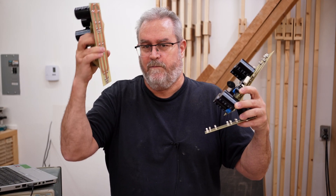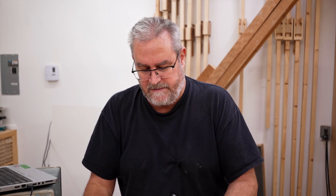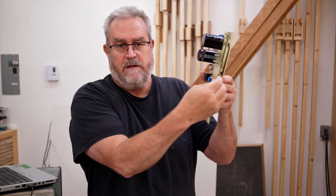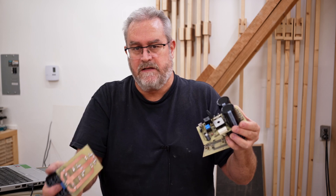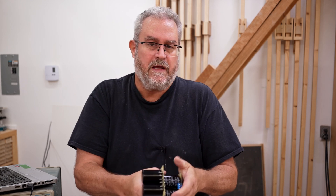These distribution boards are fed from the power supply boards. One power supply board goes with two of the longer distribution boards, and that'll cover one transformer. The other power supply goes to the shorter boards. I've decided to use the slightly bigger transformer for the two shorter ones — those four channels need more power. They'll be for the woofer and two auxiliary channels: one definitely for the bass shaker under my chair, and the other is unknown yet, held in reserve.